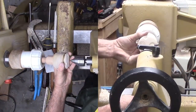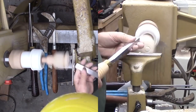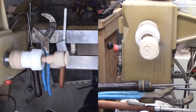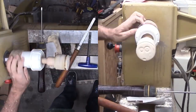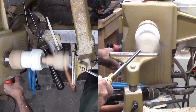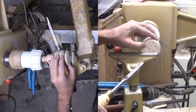Now the third feature. Each time I make sure I have cinched up the retaining ring on the chuck — I make sure with my large channel lock pliers. Now a fourth feature. When the feature cuts completely into the surface, I can sand with the lathe running at moderate speed. Since the features are small, I can sand with 180, 220, and 320 grit. When the feature does not cut completely into the surface, I have to sand with the lathe off. How about a fifth feature. When I mess up by not focusing enough on tool control, I enlarge and redesign the feature. After all, no one yet knows what it is supposed to look like.